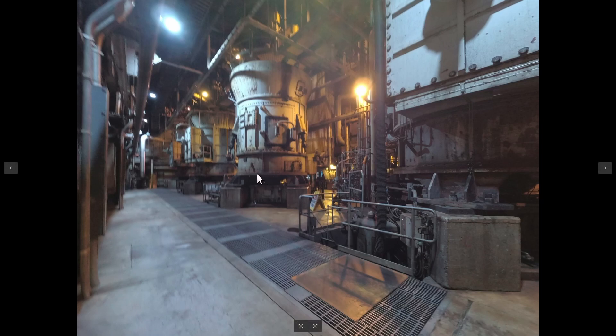You can see the four pulverizers and the difference between styles. This one here has the spring tension down here holding down the ring, along with springs up top. These rollers can move up and down but they're fixed. You have seal air coming in — the big thing is keeping seal air to keep coal dust out of the bearings.